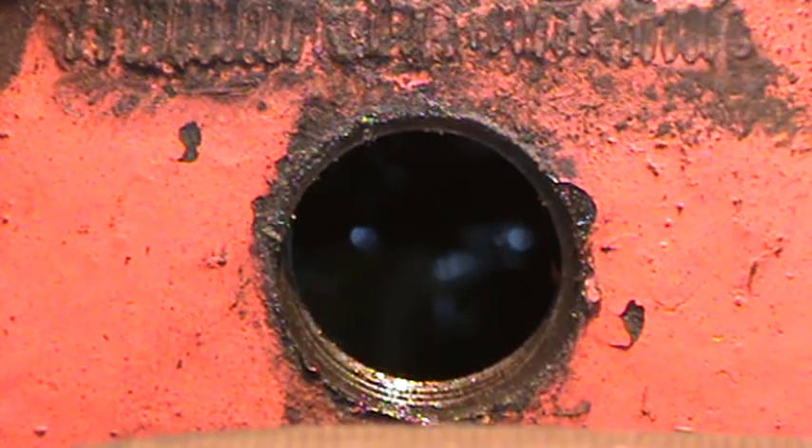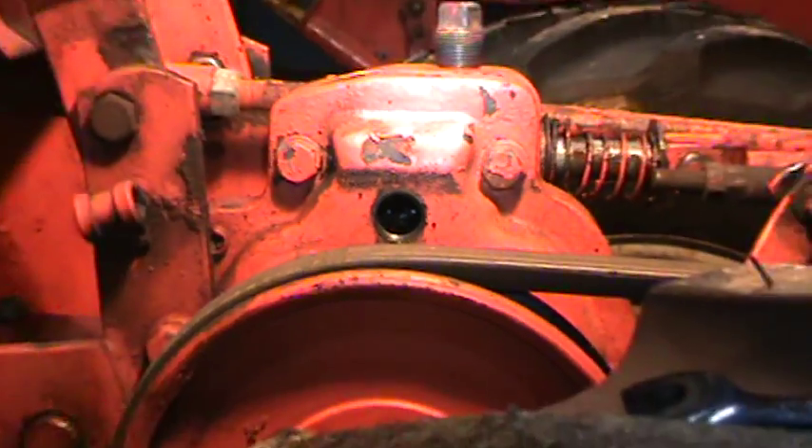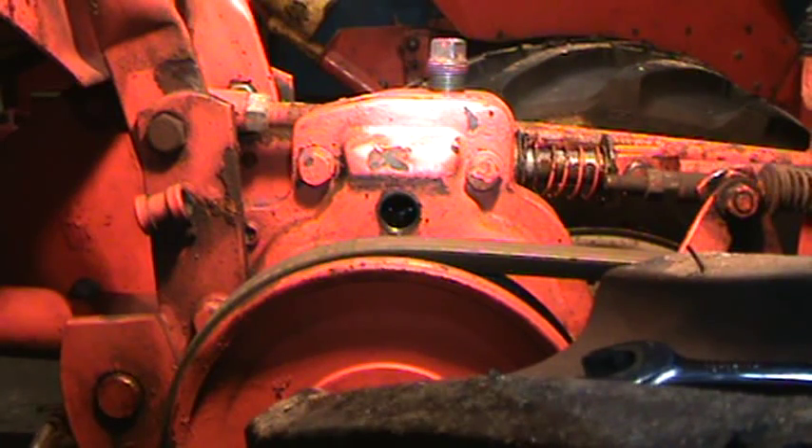You want them lined up with the two roll pins that you'll see down inside. It's actually pretty easy to do, and you don't even have to take your tire off or take anything off at all. This is something I had to do in the field a number of times, and I just always make sure I've got my screwdriver with me in my truck — that and an adjustable wrench, and I'm good to go if it gets caught between gears. If anybody's got any other questions or problems they're trying to solve with their old Allis-Chalmers Simplicity tractors, give me a holler and I'll see if I can help you out.